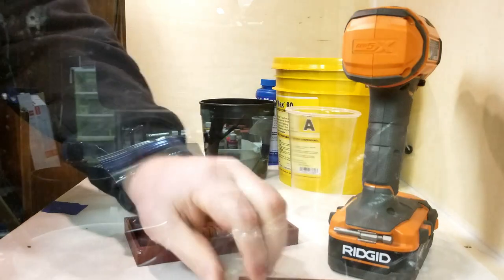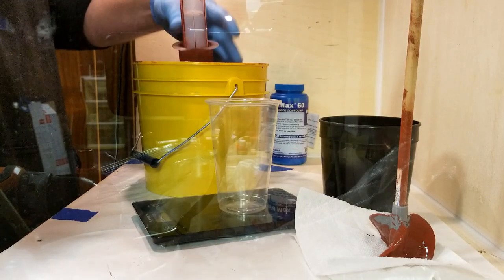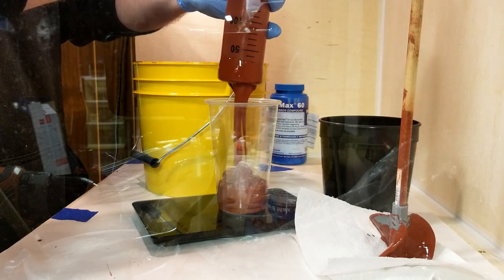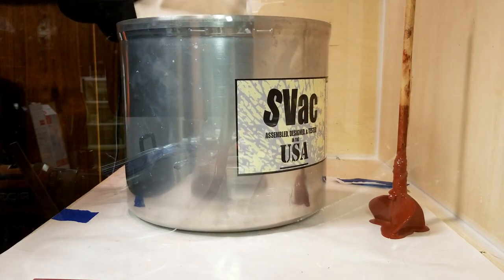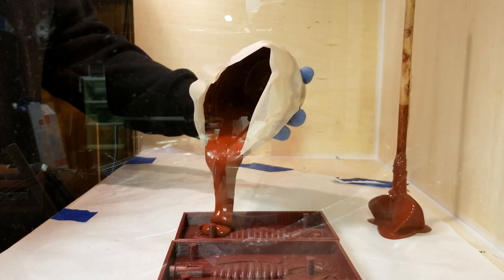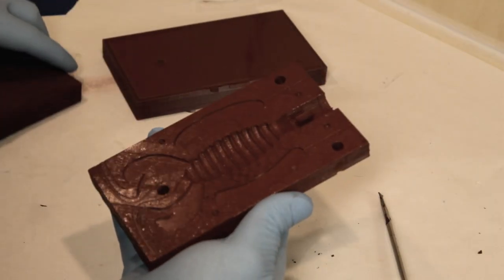When you're making these molds, the big thing to think about is the print settings. Usually on something more detailed like this, I'll print at 0.08mm layer heights. I always use PLA for my mold masters. Then it's a pretty simple process of finding the volume with rice. After you find the volume with rice, you spray it with a silicone release agent — I'm using Ease Release 200, which you can get from Smooth-On. Then you dump in your silicone of choice. I like using Mold Max 60 because it has a 60 shore hardness — it's not a soft plastic or soft rubber, it's more like just under tire rubber. Very hard once you have it molded in well. Put the two pieces together, let those sit for a little while, demold, and check if it worked with the nail.